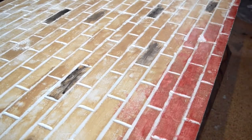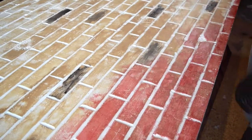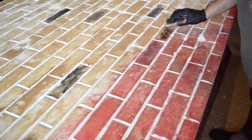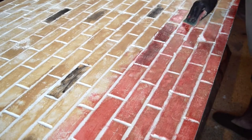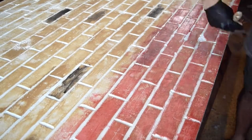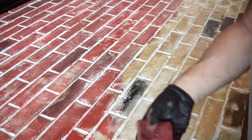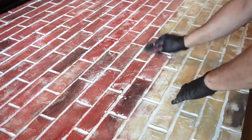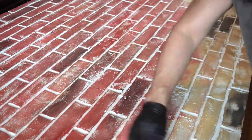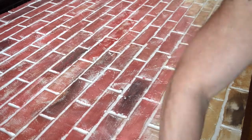You can see I'm not being careful about making sure I have even coverage — I don't care if I miss a few spots. Again, this is supposed to be old, irregular, two to three hundred-year-old brick: stain, soot mark, maybe there's been some fires around. At the end of the day I wanted this to look old. So you can see me here going through with the sponge and then blending everything together, à la Bob Ross, with a dry brush like that.